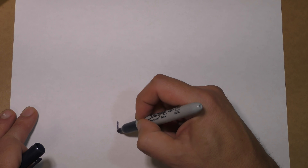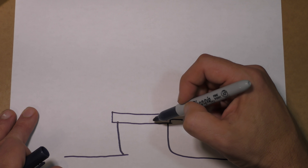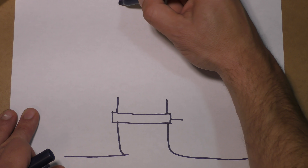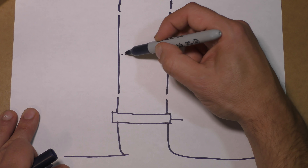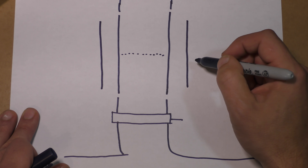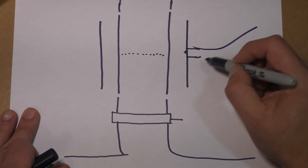Zooming in on the area that I'm changing — this is the bottom section. I'm going to add in that valve right here; that's just one of those sliding valves to cut off the water. Then I'm going to cut the piping out right here. On the section I cut out, I drilled a bunch of holes into it, and then on the outer area I've added a piece of three-inch piping. The center one is two-inch, and I tapped this and put an air fitting onto it, so there's a hole here and a tube that goes off to the air pump.